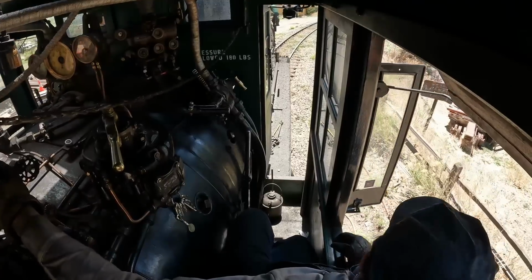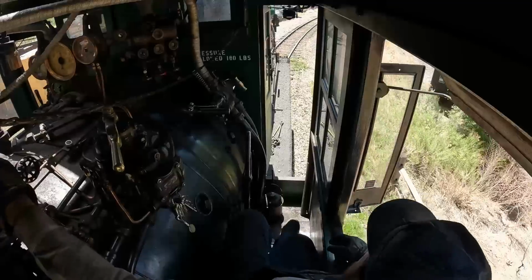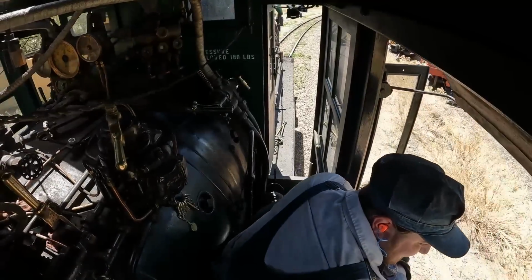And you'll see I hold the independent bailed with my left hand, which I actually don't think you need to do on the 20, but it's muscle memory from 346. I think, if I remember right, Dusty and Jeff told me that 20 doesn't set up automatically when you leave it in run because she had some special modification from the RGS. Every locomotive's different because of course it is. But I hold it bailed anyways just in case, so my engine and tender don't set up.